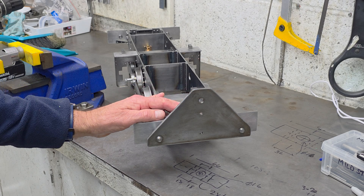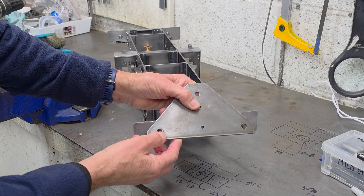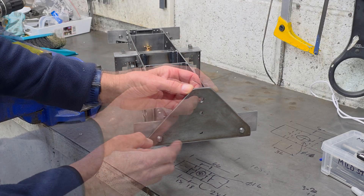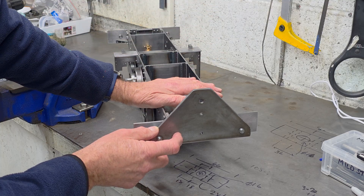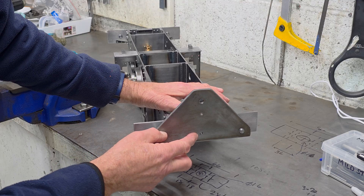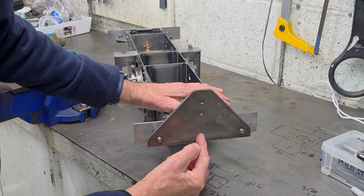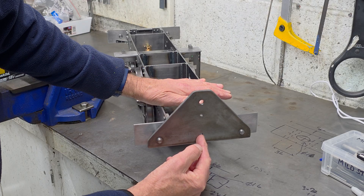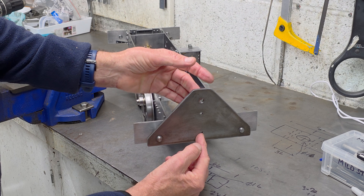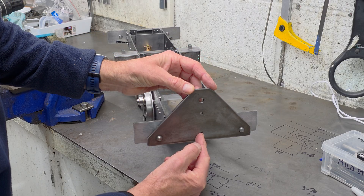Another modification that should help with the balance of the stand: the original brackets, which are mounted via the buffer holes in the buffer beams, have been designed with quite an offset. The buffer beams are quite a long way from the centre of rotation. I did it that way to compensate for the superstructure that will come onto the locomotive as it develops. But of course all the weight, until I get the boiler on, is down on the bottom half. So I'm going to modify this bracket — probably open this hole out here, which is on the centre line almost — drill that out and tap it for M12, so my centre of rotation is much closer to the weight. It will be a little bit offset because of the wheels and cylinders sitting slightly below, but certainly better than having the whole lot pivoting around the top. When I add the boiler and superstructure, I can remount it using the top hole to bring the centre of rotation more central to the loco.